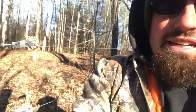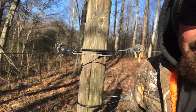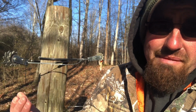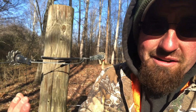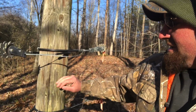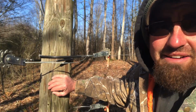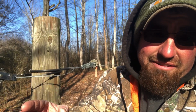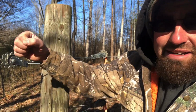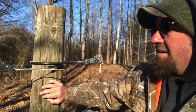And I've seen guys, they make these springs that actually go in the wire, but once you pull your fence that tight, you've got those springs pulled tight as well, so they might as well not be there because they're already pulled to their maximum adjustment. So anyways, I just keep it tight enough to where when you're looking down that line, it's a straight line down through there. And I'll come through maybe every 6 months to a year and just tighten this up, maybe 1 or 2 clicks, just enough to stretch out that wire again. It's not that much maintenance on it at all.